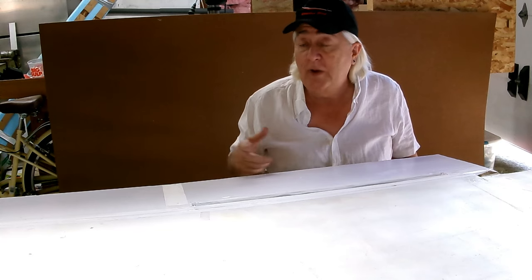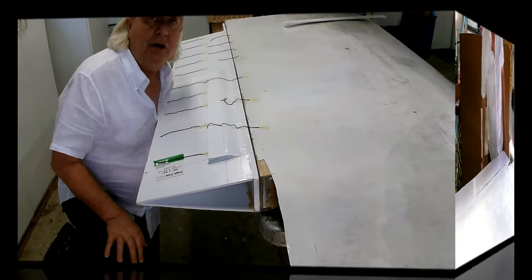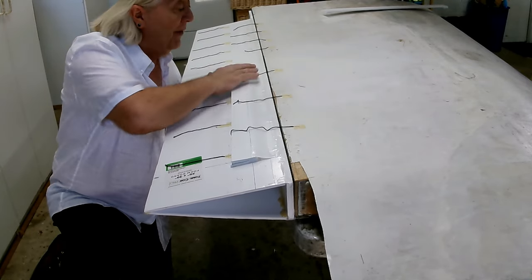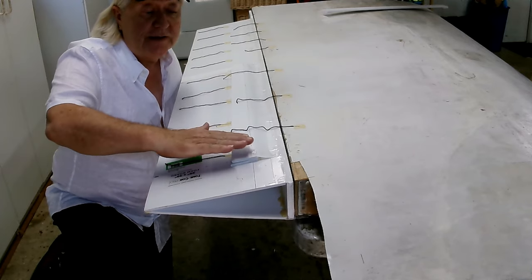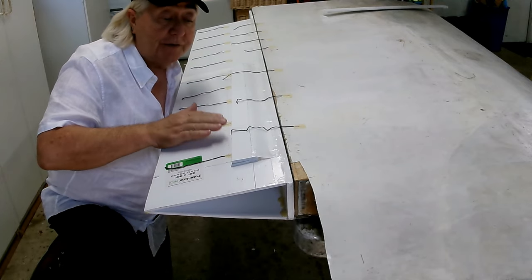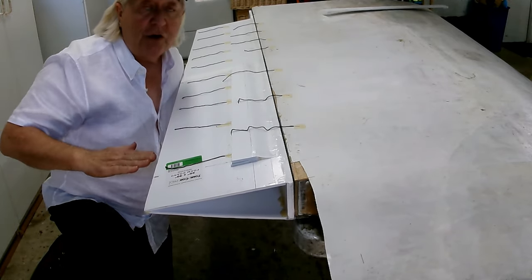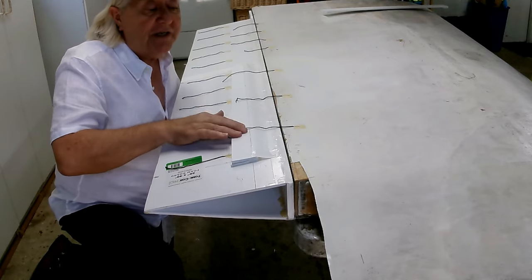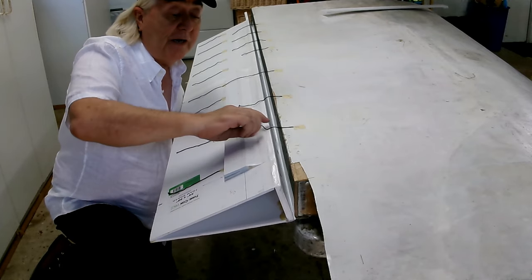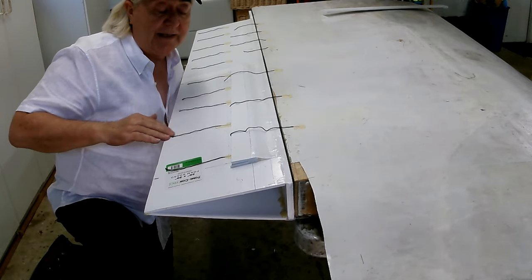I'm going to flip the wing over now. Here we see the top of the wing, and I've got some tufts on here so I can study the flow. What I've done is put a cover over the opening for the slot that goes through the control surface, so that as the air goes up through that plenum, it has to turn because of this cover and go back along the control surface — at least that's what I hope it does. We've seen on my wing that when the flap is deflected about this far, these tufts come back about here and turn 90 degrees out along the span. What we're hoping to see is that these tufts continue to go straight and stay nice and straight.